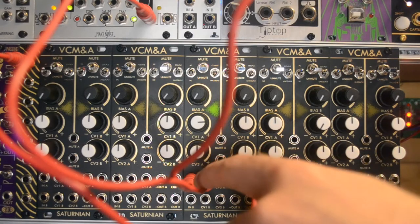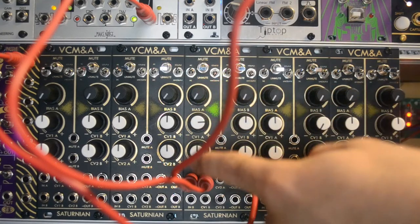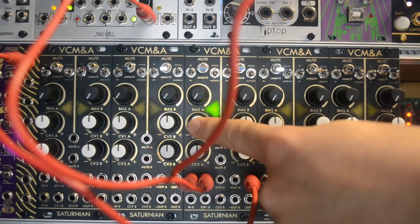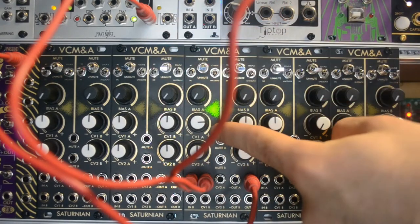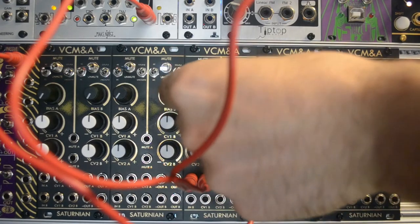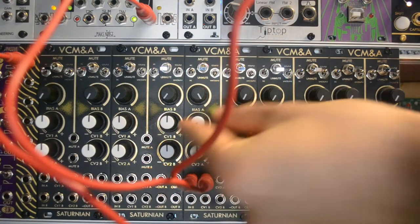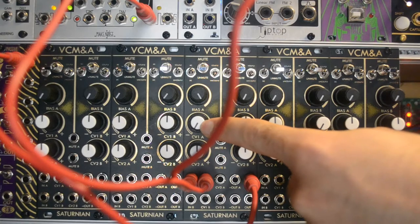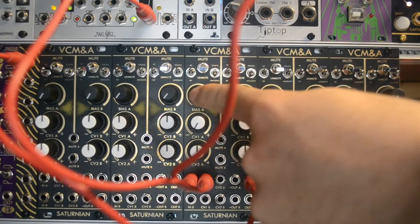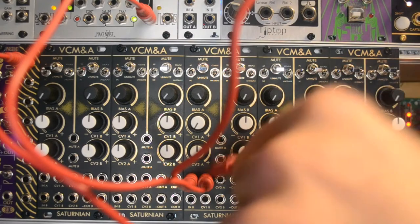The two control voltage signals and the bias will sum together to give the gain of the amplifier. Since we have attenuverter controls for the control voltages, we can also use the negated version of our CV1 signal to subtract from the bias, giving the opposite response to the one before. We can add a different control voltage to the mix via CV2, giving a more interesting response.